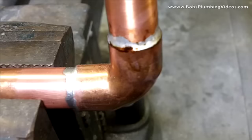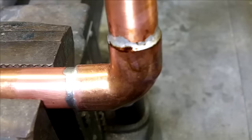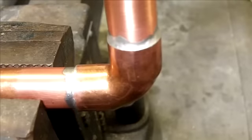That, my friends, is a beautiful thing. I did not use a lot of solder and did not continually feed it in — especially on a vertical joint. On a vertical joint, unlike a horizontal where excess solder comes out the bottom, excess solder flows inside the pipe and fitting. That's a bad thing because if some of that solder breaks loose later on, it'll get caught up in your faucets and throughout your plumbing system. This is not difficult to do if you follow the steps.